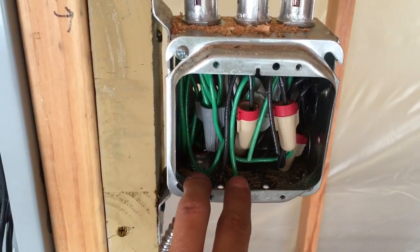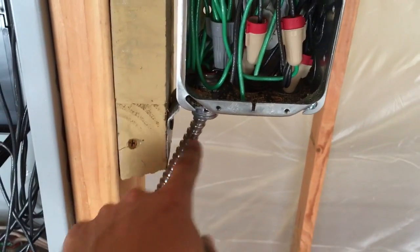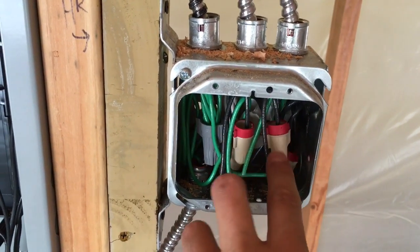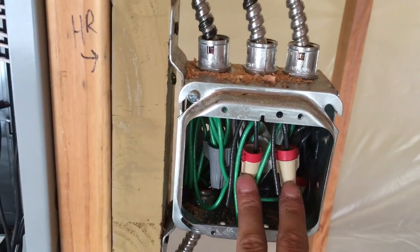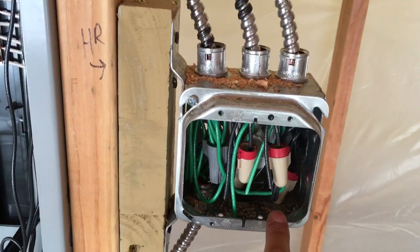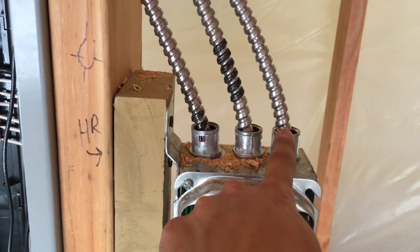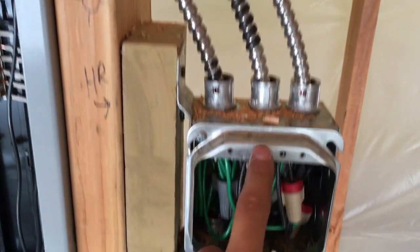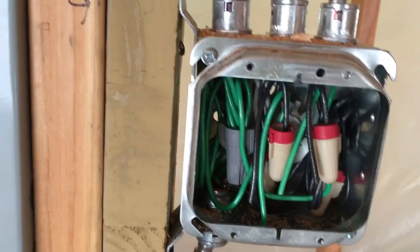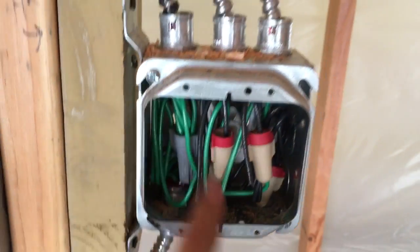Making those up is a little more complicated, but basically in each wire you have black, white, and green. The black wire is the power, and because you have two switches here you have to split that into two power wires — which are these two that are capped off, so it's safe. The other two wires: one is the black wire for this switch and the other black wire is for that switch. So you have two wires on a switch — a power wire and a switch wire. Tie all your grounds together, tie all your whites together, and that's basically it.